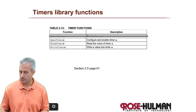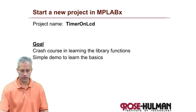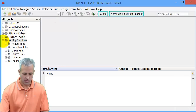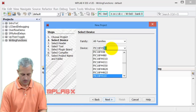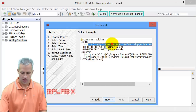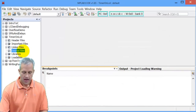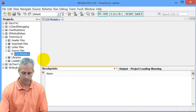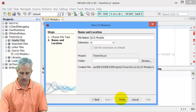Let's do an example program that exercises those three functions. Go ahead and fire up MPLAB. I'm going to make a new project for the PIC18F4520 using the PICkit 3 and our compiler - I'll call it 'timer on LCD'. Since we're using the LCD, we'll need the LCD helper module and LCD dot H, so don't change the name on those, just leave them as the LCD module.